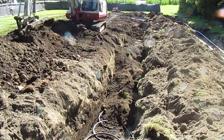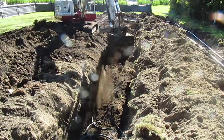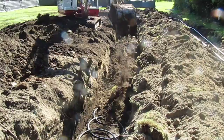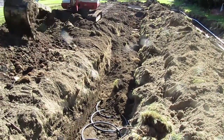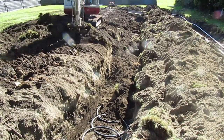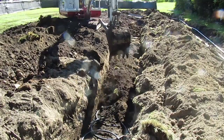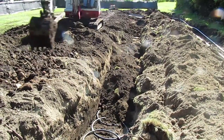Initially, the first dump of soil he puts on the loop is going to be very rock-free, and we're just watching it to make sure, while keeping the pressure testing going at the same time so we can monitor that there are no leaks.